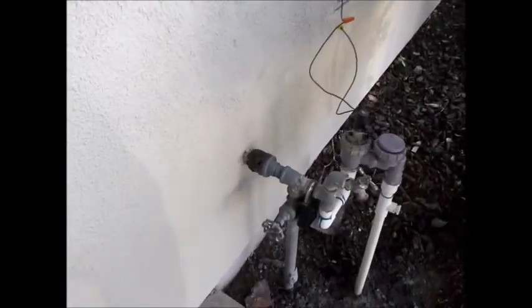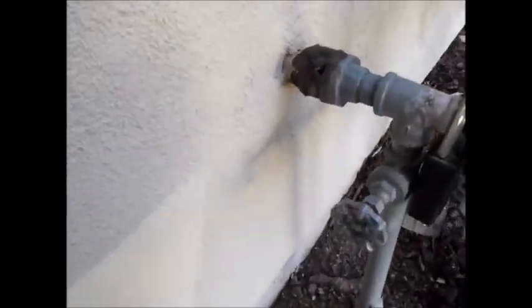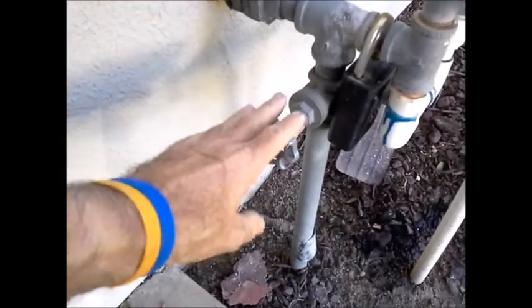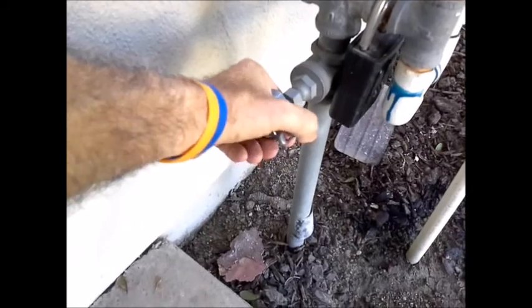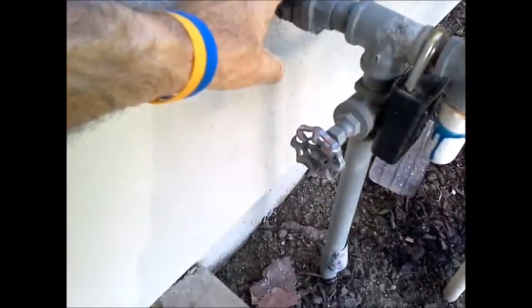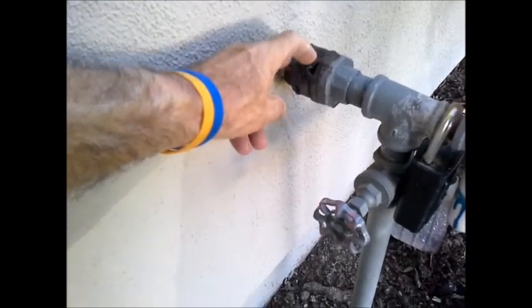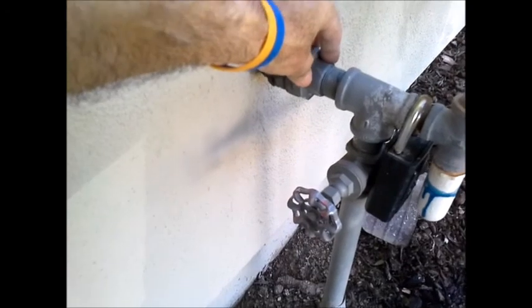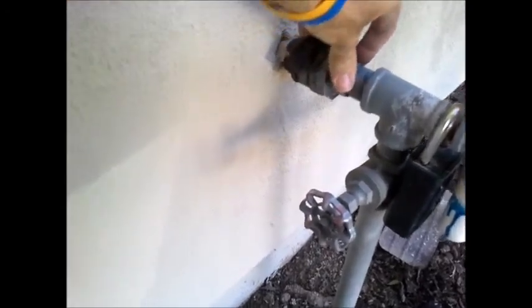The front of the house, you'll find the water line coming in. It's a 1-inch water line with a gate valve here. This is how you shut it off. It's galvanized, and the supply to the house is galvanized, and they did a repair with this tar or putty. There are some other rust areas in the galvanized.